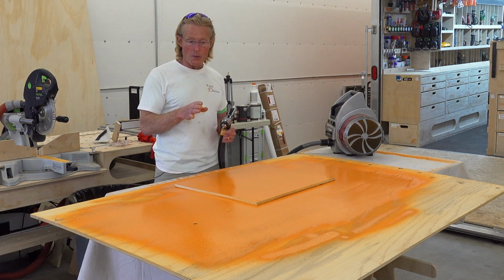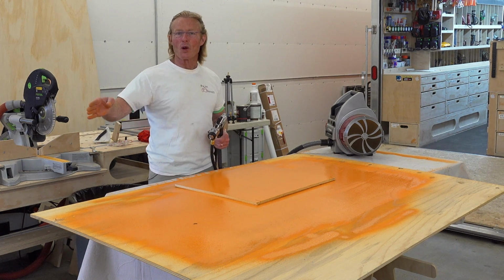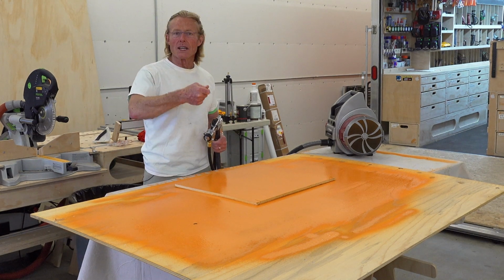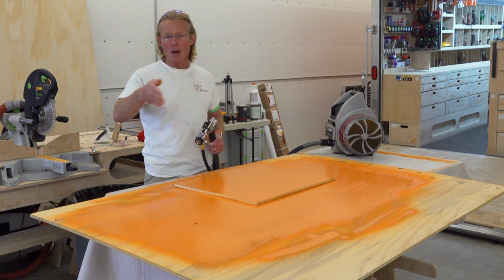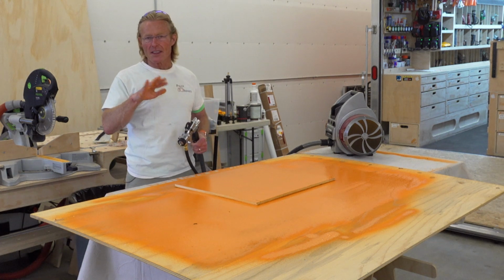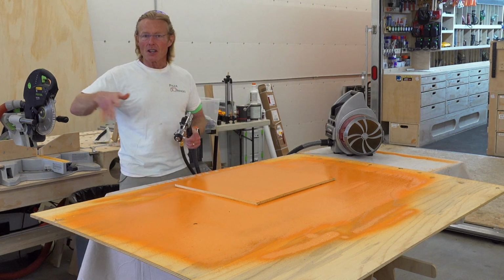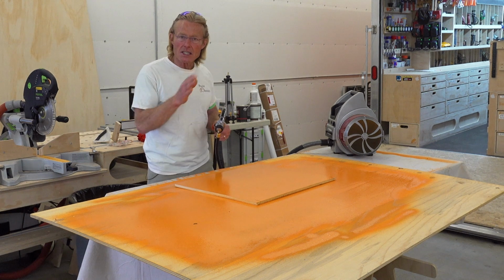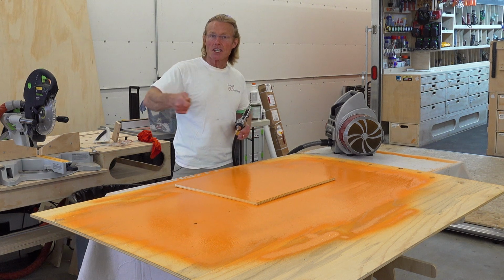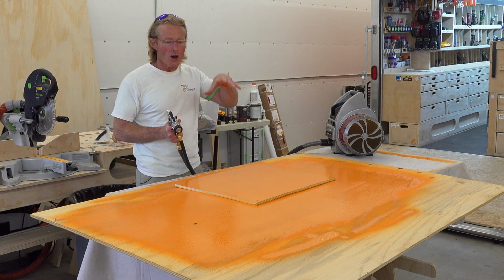I will probably, again, in a situation where I have a lot of room, like on an OSB or a framed floor, when I don't have finish down and I've got a lot of palette to work with, I'll set up my material, I'll deal with just my material viscosity. That'll be the only thing I'll change. I'll do that, and then once I feel like that's close, then I'll play with the material flow, just that, and then do some samples and tests until I have a real good feeling for that. And then I'll isolate the airflow, and I will play with just adjusting that, so I'll get to see what each thing does. And of course, they all have to work together. It's a chorus to get it all just right.